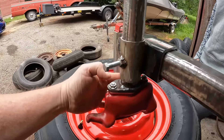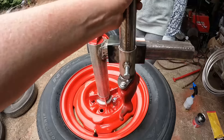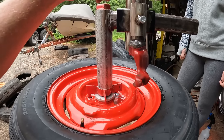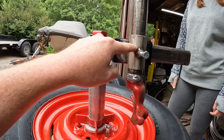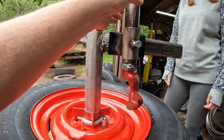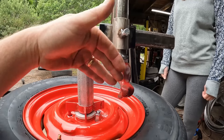All you need to do is crudely cut out the top — I put a piece of cardboard on it, cut it out with the death wheel, punch two holes in it, and weld it to a piece of pipe that slides in another piece of pipe. You don't need pipe where the internal and external diameters match — you could use a square piece of tubing and a round piece of pipe, then drill the square at an angle so it pushes the round into the corner.